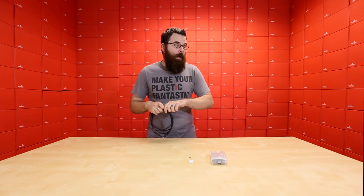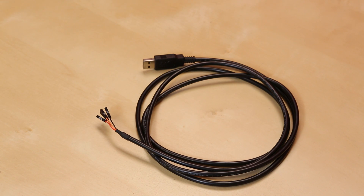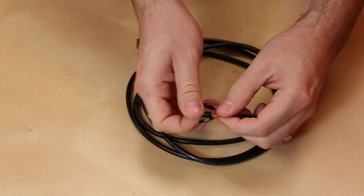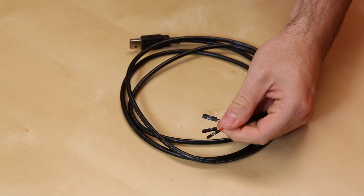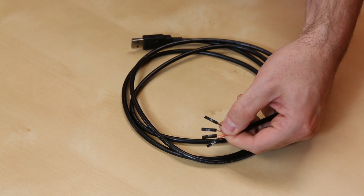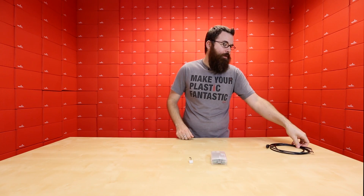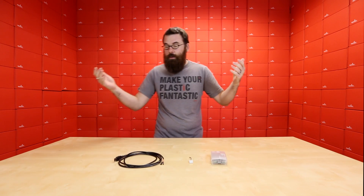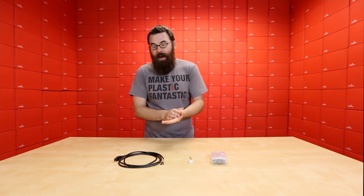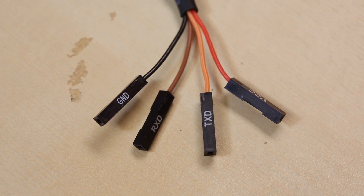Speaking of Raspberry Pi, we have a new cable for all you Pi fans. This is an FTDI cable for use with Raspberry Pi. It's very similar to our standard FTDI cable except the ends have individual little plugs instead of a combined plug. You can see we have VCC, TX, RX, and ground. You can plug these anywhere you need on the GPIOs instead of having them combined. This is a 3-volt cable so it works well with the Pi, and of course you can use it as a standard USB FTDI cable for pretty much anything else — it just has these nice individual connectors which make it easier to use on something like the Pi.